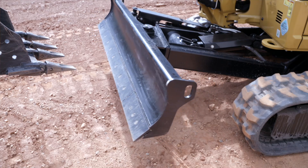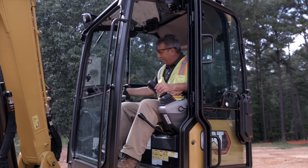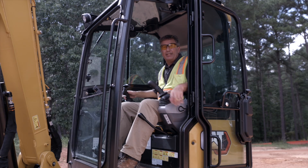If we look at our icon it says '1B' — 1 means we're in excavator mode, B means the right hand is in blade. If it said A, the right hand would be linkage. We're going to do some grading and final grading, so we're in 1B.